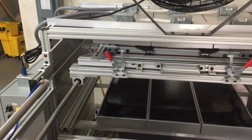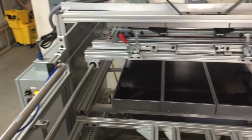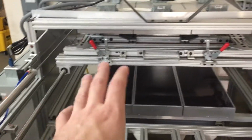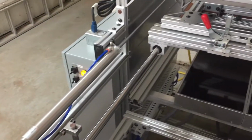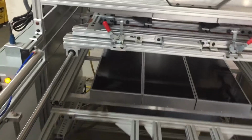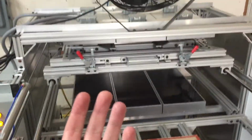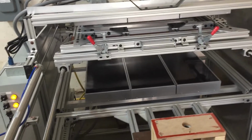See, it hits really hard. That bugs me. And the problem is you want this thing to go back. You can adjust some of the things on the piston. There's another one over here for how the air comes in. Problem is, as you make adjustments, that also affects how it comes out. And you do want it to come out relatively quick before the plastic gets too cold.